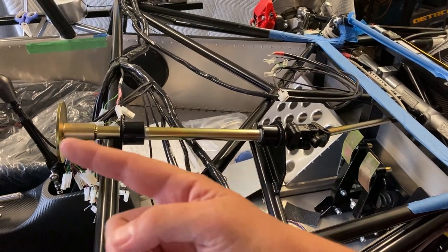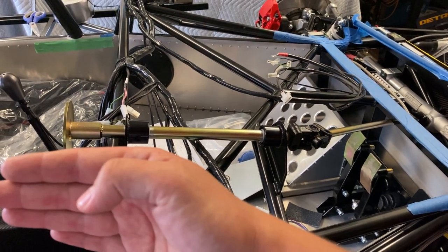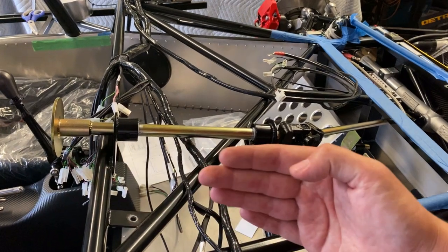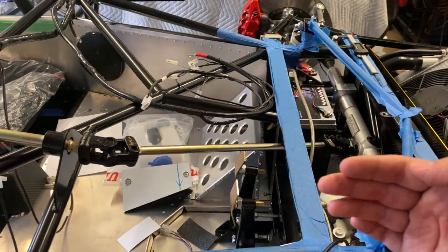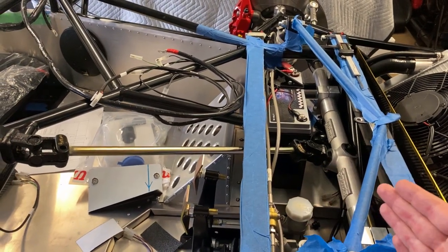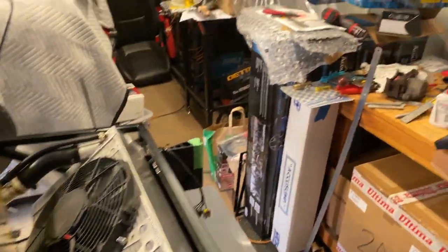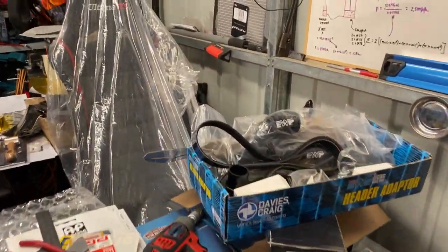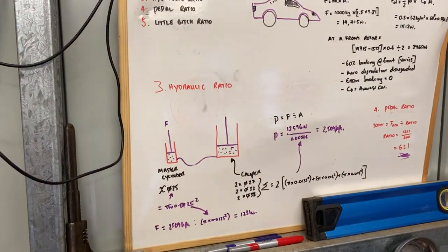Here's our steering arrangement. We've got where the wheel bolts up via its crush zone and Raptor controller — that will be our input to this steering shaft. Then we've got a universal joint that allows for two planes of misalignment. It then passes through the firewall and attaches to the steering rack. The important thing to conceptualize here is that you're generally trading off speed and force.